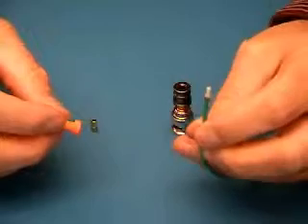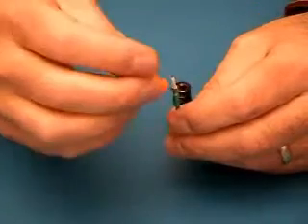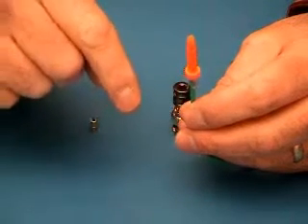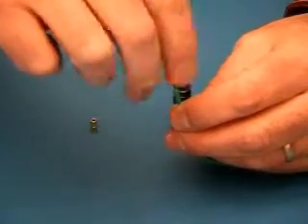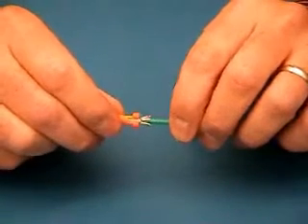A change in our directions: we put the pin on first, versus the compression support ring. Lay this on here and allow gravity to let it drop on — do not push it down, because you can cause the center strands to birdcage on the center conductor. Spin this down; it is just like a wire nut that has threads. Once it seats against the dielectric, the brass pin will seat all the way against the dielectric.